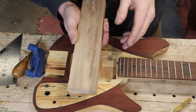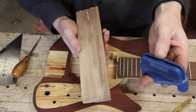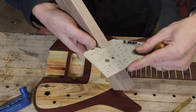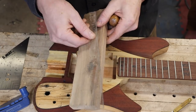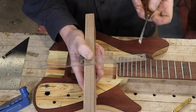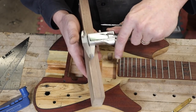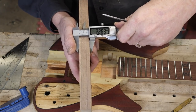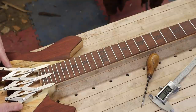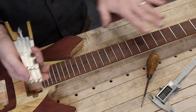There are a bunch of other types of center-finding tools out there. The one I created doesn't necessarily do everything all of those tools do — it's filling some voids of what they don't do. There's the common spinning type, and I made it so you can do that too with a visual mark. There are center-finding rulers where you start with zero in the middle and count to either side, but I don't need to know the number most of the time — I just need to know where the center is. We can always just measure: that's 22.69, so I go 11.34. But I wanted a quicker way. I can just squeeze this little tool here, make a mark, go up here, squeeze it, make a mark, connect those two dots, and I have my center. Done.